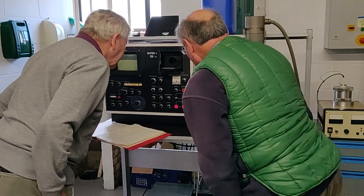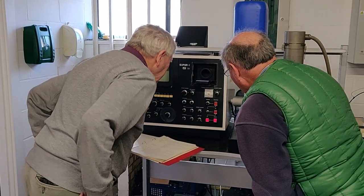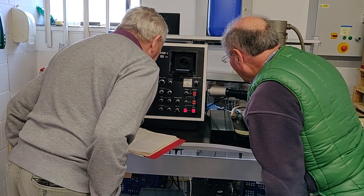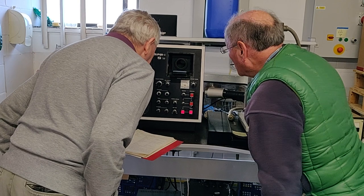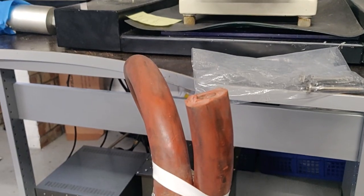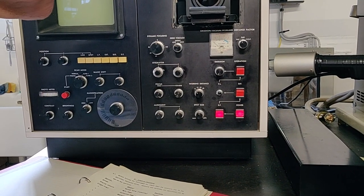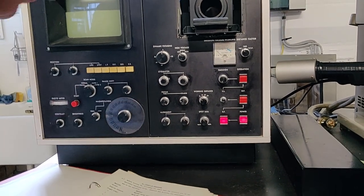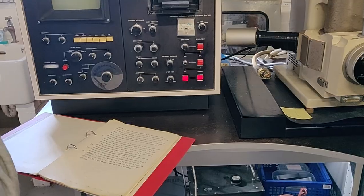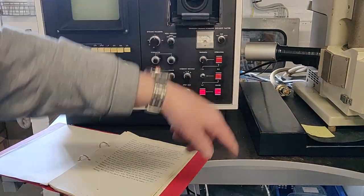Vacuum tube. The diffusion pump's not on, so that's so far. See when that starts leading to something. It may take a while. Do we want to get cooling on this then? No, not at the moment. What are we expecting? The emission vacuum? I'd expect this gauge to start dropping in a minute. At the moment we're pretending that the diffusion pump's turned on, but it's not actually turned on, so I'm now trying to rough out the whole column through the rotary pump.